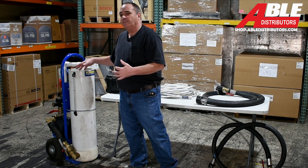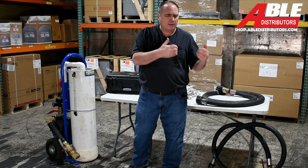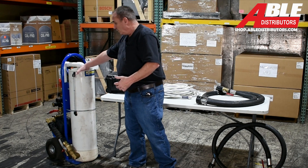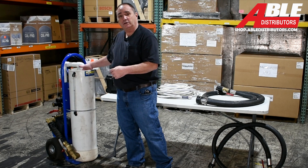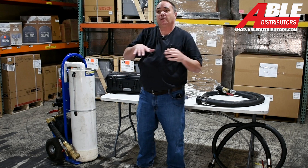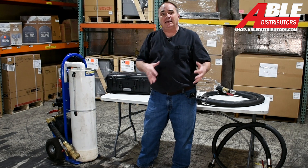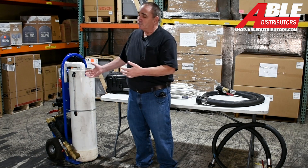The flush cart can be used to fill big glycol systems, snow melt systems, and geothermal systems with glycol. If you hook this up at the manifolds and want to work the air out, you'd fill this with glycol, pump it into the system, recirculate as air spurts out, and your field could be full with the air worked out. You can also fill this up with water, add chemical, and clean a system — that's typically what we use it for most of the time.